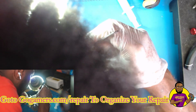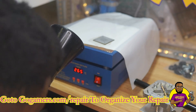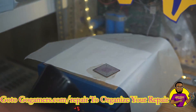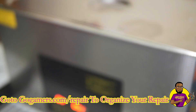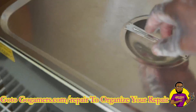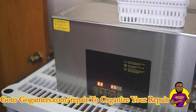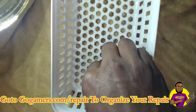I had to make sure all the solder balls were completely aligned. Now we put it on our preheater machine — it was a bit difficult working around the camera — and you can see it preheating the BGA chip, which just melts the solder on the chip. I find the preheater easier than a heat wand because it reduces the risk of any solder balls being blown away.